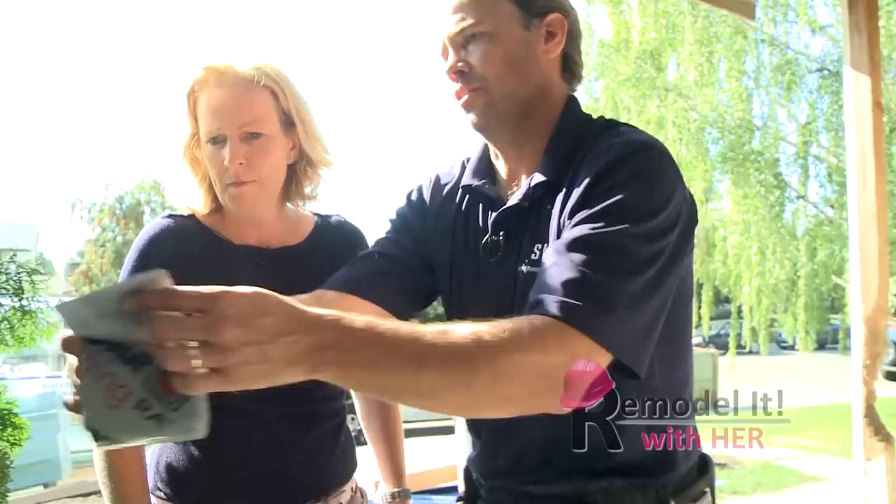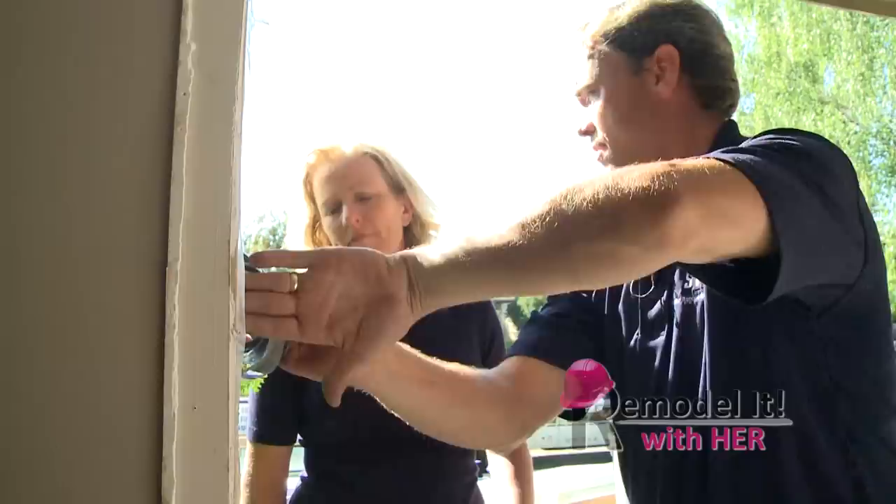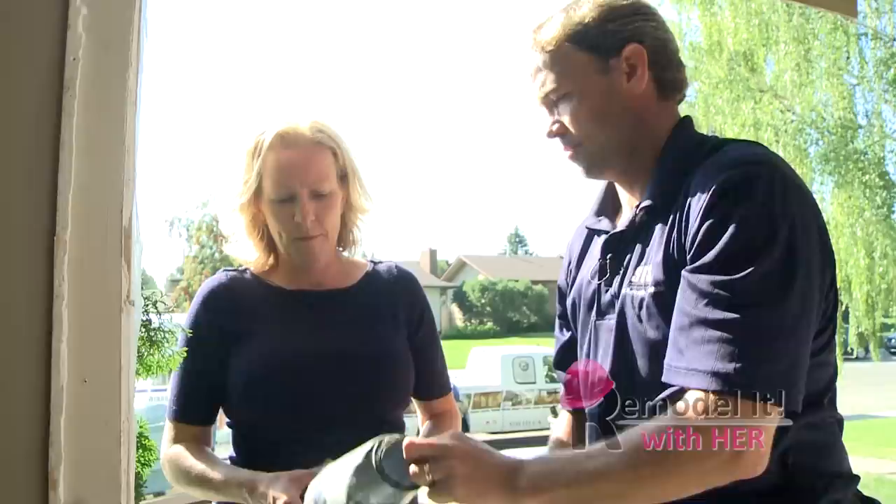So you can do this side — this time we're just going to stick it on the face, then our fin of our window is going to go over it, and then we have another membrane that's going to go over the fin. So just start peeling that off, start up top and come down — maybe about six inches above where your primer is. Work your way down, no wrinkles.